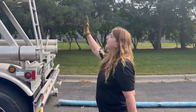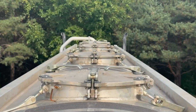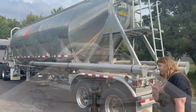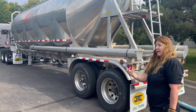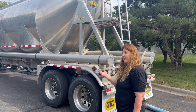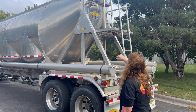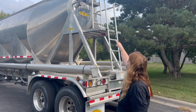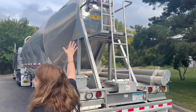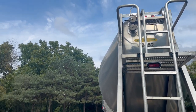I go on top of the trailer and open up every lid. I reach down in there and put my hand up underneath the lip, because a lot of product likes to get stuck between there, and I usually take a rag up with me and wipe it off. I close all the lids, wipe out my stinger caps, put the caps back on, then I engage my blower.